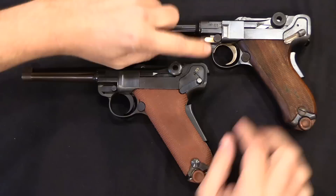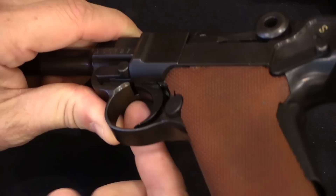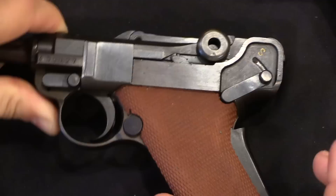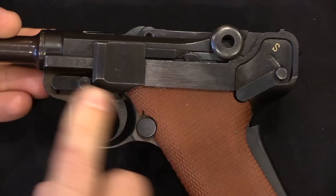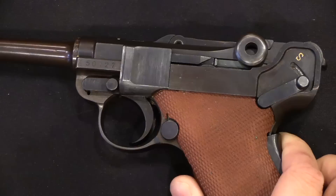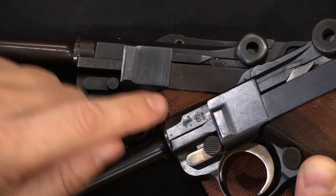With a mind towards simplification, there were a bunch more changes made. On the original Luger you have this interesting half-moon or three-quarter circle trigger lever that comes all the way out to the front. The Swiss got rid of that — the 1929 has a much more traditional style of trigger that just ends here; it doesn't have any need to come through the front part of the trigger guard. They also took all of the checkering and serrations off of the controls. Originally the takedown lever, the magazine release, and the toggle knobs were all checkered, and the safety lever was serrated. On the 1929 all of these surfaces are smooth.